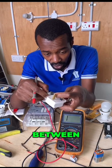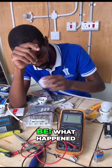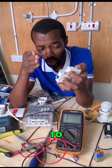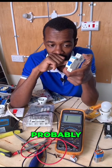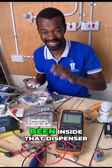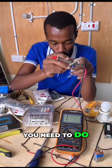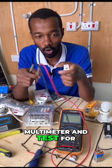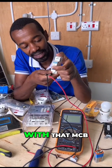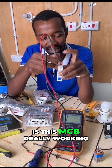You have checked the dispenser between the neutral and the ground and you still get a reading of one — you are good to go. So the question will be: what happened? What is the reason why the MCB tripped? This MCB was supplying power to the dispenser. At that point where you are troubleshooting, probably there was a short circuit that happened. And if you don't find it very fast, it means it probably might have been inside that dispenser and it sorted itself out. Another important thing you need to do is use a digital multimeter and test for continuity.